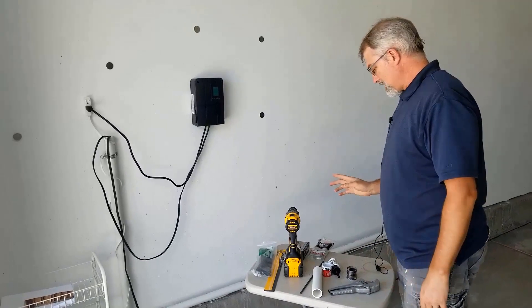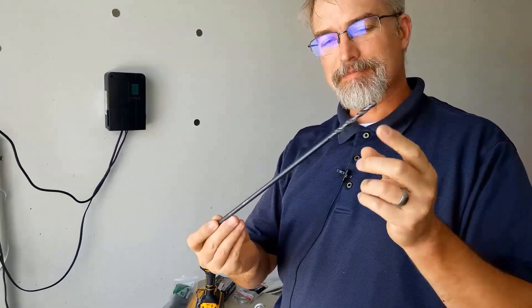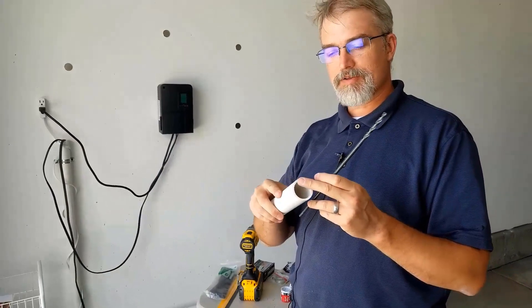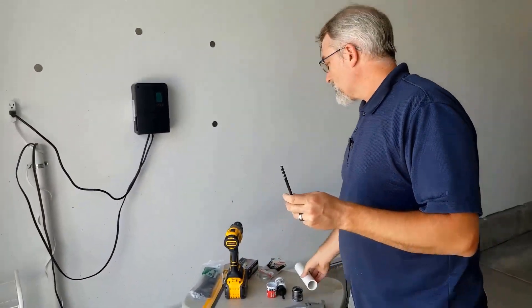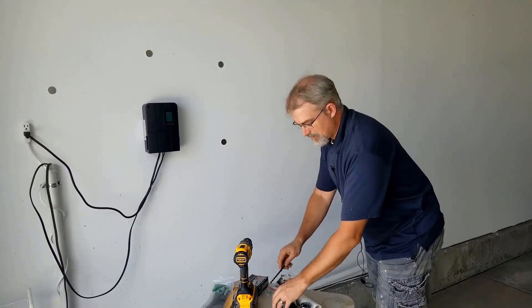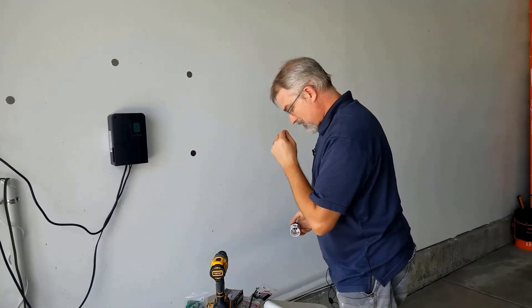So first I had to drill a hole. From the outside I got this big long drill bit and found the best place I could. I found a spot with enough mortar — I didn't want to drill through the stone on the outside — and tried to center it and drilled through. I drilled from the outside all the way in, piercing through to the inner wall, so I could line them up. Then I came from the other side to drill the bigger hole on each side and put the tube through knowing they'd connect.